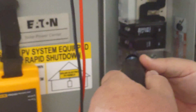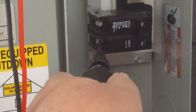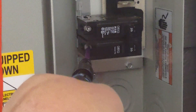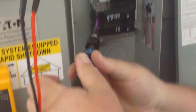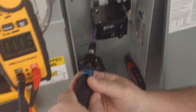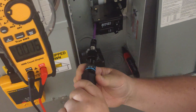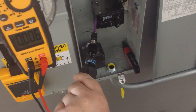We're going to put it inside the screw here. We do not want to use power tools here — we want to use hand tools so we're not breaking these soft metal items. So we're going to go ahead and twist. You'll hear the click where it actually jumps. What I want to show you is that as I tighten, the tool actually jumps over — and that means that item is now torqued properly.